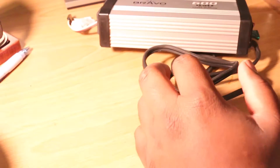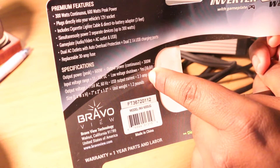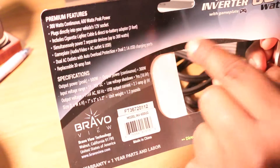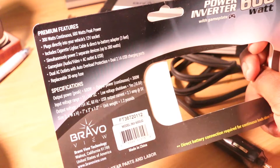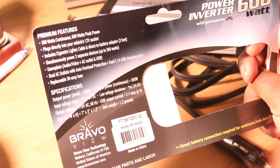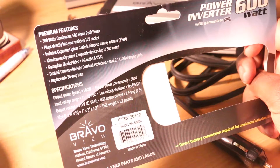This is marketed as 600-watt DC to AC, but that's actually not the case, and I hate when companies do this. If you look on here, the output peak is 600 watts, but the output continuous is 300 watts. Anytime you look at an inverter, always look at the continuous power — continuous power means it'll deliver 300 watts constantly. The 600-watt peak might only be for a minute, five minutes, or even just a second. So this is actually a 300-watt inverter.